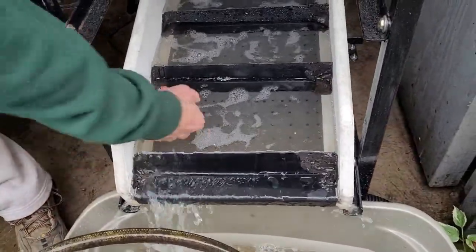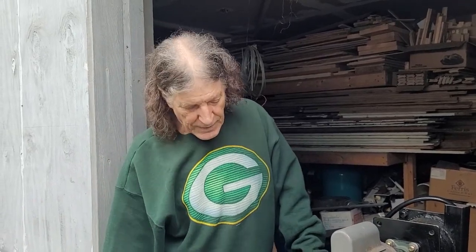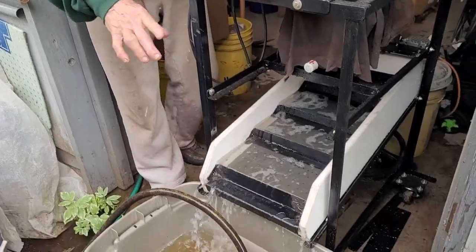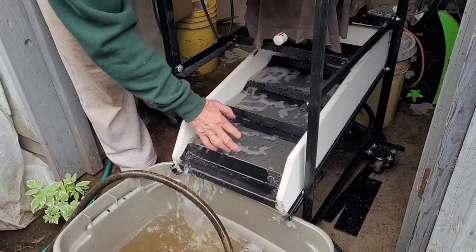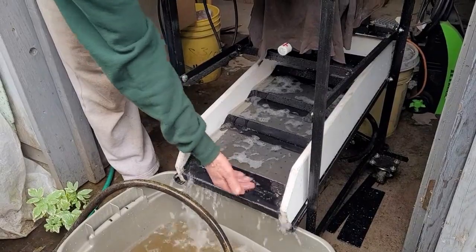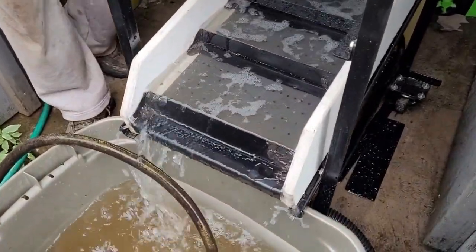We're running our water a whole lot slower. Whenever you run your water or air slowly — like a dry washer running air very slowly so the dry material advances very slowly — you have to have the riffles running backwards. Same principle here: we're running very slow moving water, so you're not going to get separation on the back side of the riffle, so these riffles have to be slanted backwards, just like on a dry washer.